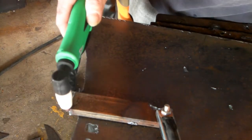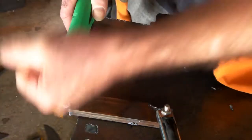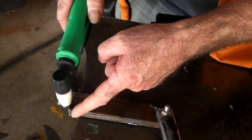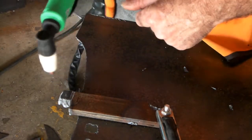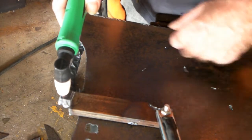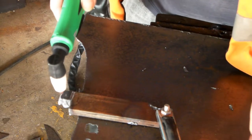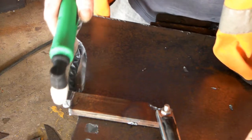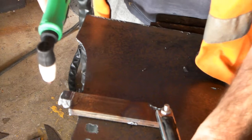See that guys — I came down here, and once I was in the cut and had the flow going through my steel, I went that way. I didn't have to come out and start again because I still had the cut going — I could just steer the cut in whatever direction I wanted. I've still got this piece here. Don't start in the middle of your steel if you can possibly help it, especially if it's really thick, unless you drill a hole through it. Anyway, that's the tip for the day — it'll get you twice the life out of your drag tips.